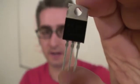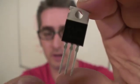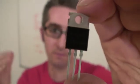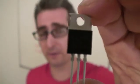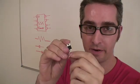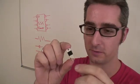There are a few things you need to know about regulators. First are the pins. You've got an input, a ground, and an output. You can remember that by remembering IGO — input, ground, output. You've also got a heat sink up here which also works as a ground. A regulator takes a bunch of voltage and turns it into a certain amount of voltage — in this case, 5 volts, which is what we need.